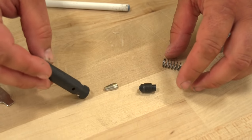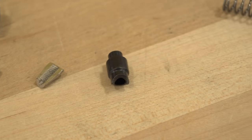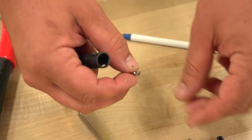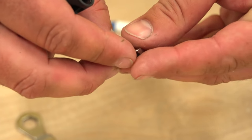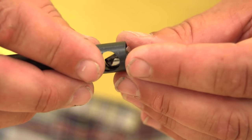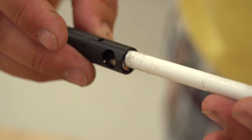Now you have access to all those parts in the barrel. To reassemble the rivet tool, hold the jaws together so they form a cone shape and carefully insert them into the barrel held horizontally. Then, using the end of a BIC pen again, push the jaws slowly to the end of the barrel.